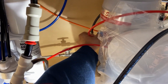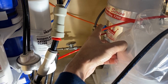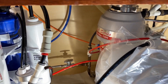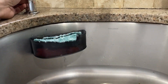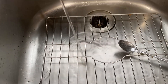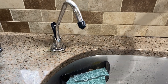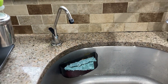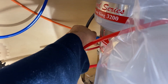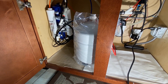Close the easy adapter valve first — the tank is now filled. Then go back to your faucet and open it so all the water inside the tank empties out. Now repeat this process two more times: once the water is empty, open the easy adapter valve and let the water come through, then empty it out again. Open the easy adapter valve to let the tank fill, wait another two hours, then empty it out.